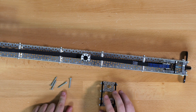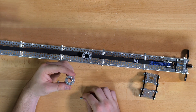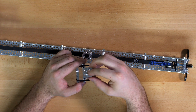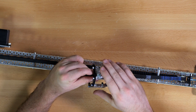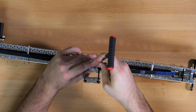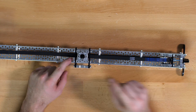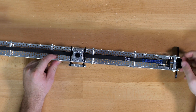Once that is on, you will use your one inch screws and they will go into the non-tapped holes, sliding all the way through the non-tapped holes on the top and screwing into place. Then it just snaps onto the channel, and you can tighten the tensioner until you have the tension just the way you want it — which will end up being about as tight as you can get it.